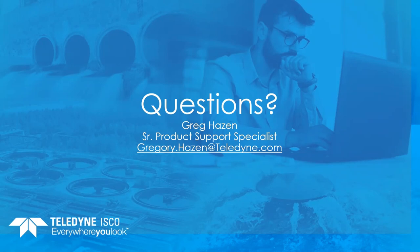On SDI-12 capability: the 6712 sampler can receive SDI-12 messages. This allows you to bring in parameters such as level from a sonde or other device, and use those values — like pH or turbidity — for enabling, disabling, or triggering sampling. The SDI-12 capability of the 6712 allows you to bring that information in and use it for triggering and enabling.